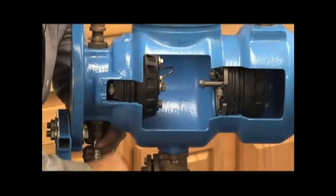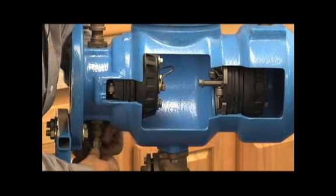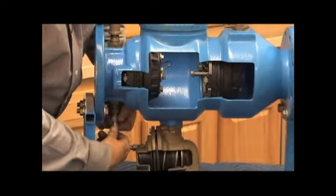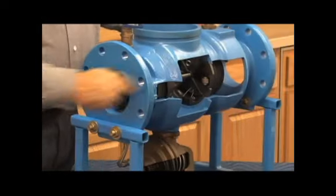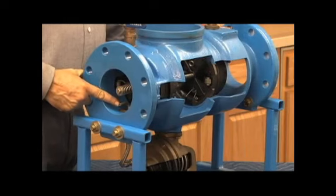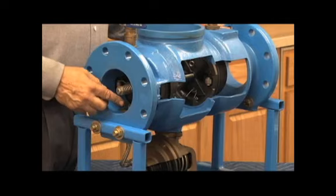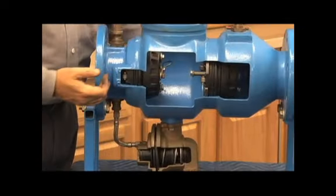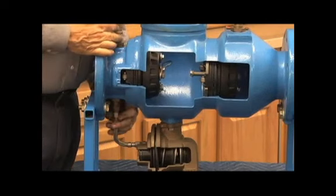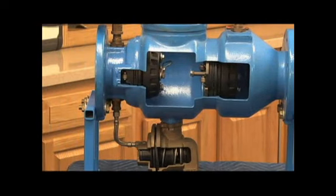So to make sure we don't have a problem with the velocity actually siphoning the water off the top of our relief valve high pressure sensing line, they've put what's called a pitot tube. And what the pitot tube makes sure is that the maximum pressure is generated here to the top of that relief valve. And as the water flows through there, it makes sure that any quick velocity or turbulence isn't affected by that particular part, by putting the optimum pressure on our relief valve cover.